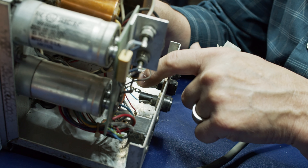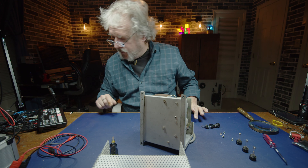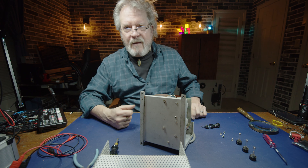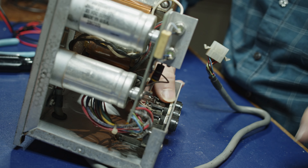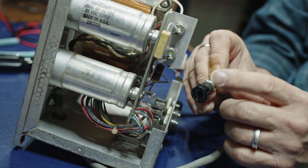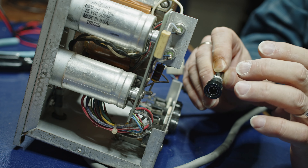In fact, this middle fuse holder right here has actually got two wires on it. I'm going to start with the broken one first because it ticked me off. I'm going to need my needle nose - not the long nose - just get it loose and then we can spin it. I'm sort of curious looking at this thing because oftentimes these fuse holders have a flat spot on there, which allows you to slide it into the hole and put the nut on without it spinning on you. It holds on while you're trying to get the nut down.